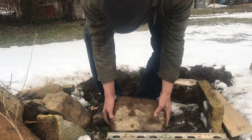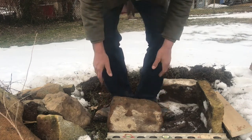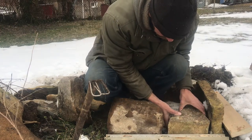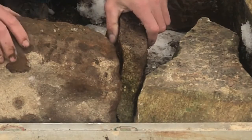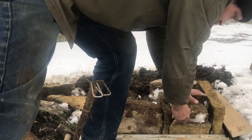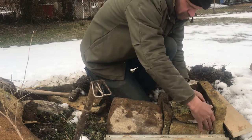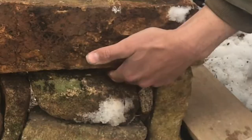Some people think you should put the heavy stones at the bottom and use smaller stones as you go up. I don't do this for two reasons. First, stone walls and columns should be held together primarily by gravity, so if I put some of the heavier stones at the top that helps lock everything into place down below — anything underneath a heavy stone is not going anywhere, end of story. Secondly, bigger stones have a greater visual impact when they're higher up in the wall. Down on the ground nobody sees them, but staggered through the work they look impressive.